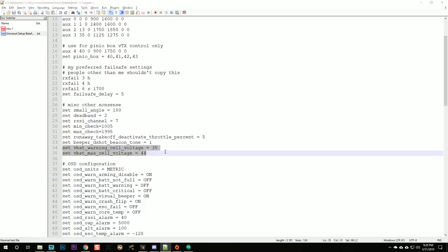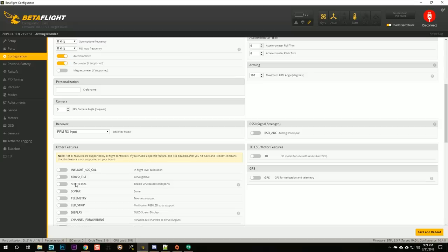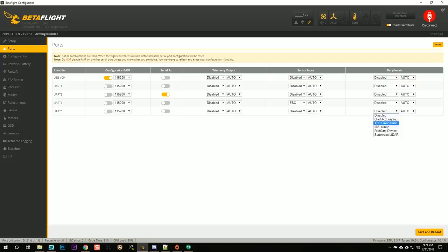VBAT warning and max: I set VBAT max to 4.4 volts instead of 4.3 volts because Betaflight uses that setting to figure out the number of cells — at 4.3V it can sometimes confuse a fully charged 4S for an empty 5S. I also use high volt batteries sometimes. Crossfire is on UART3 as Serial RX. ESC telemetry is on UART4 RX, and Smart Audio VTX control will be on UART4 TX — we need resource remapping for that. Since the Radix doesn't support Soft Serial, I'll use UART6 for Smart Audio and UART1 for GPS.